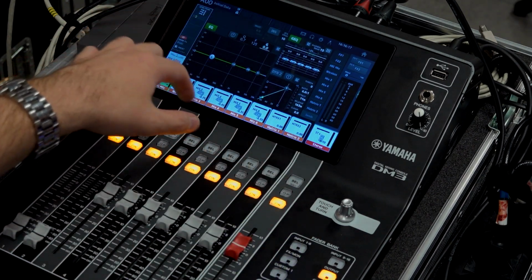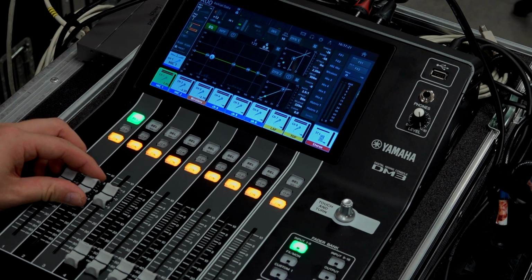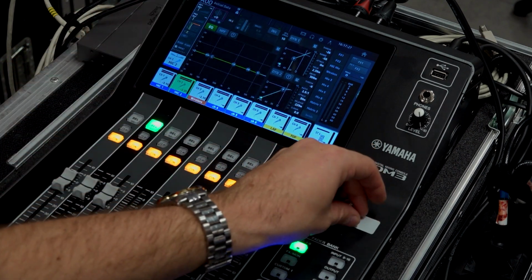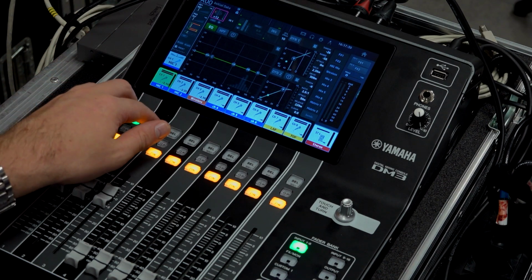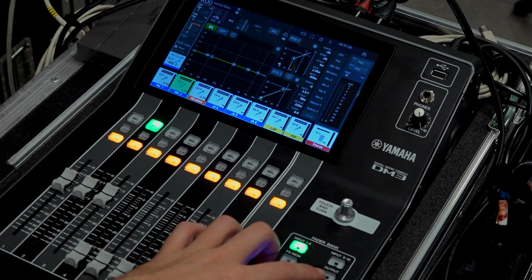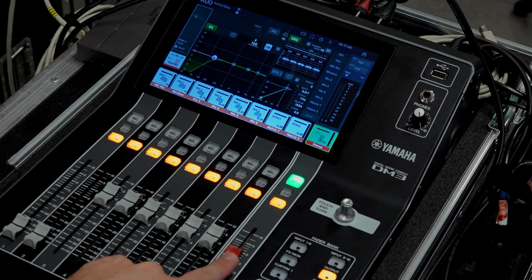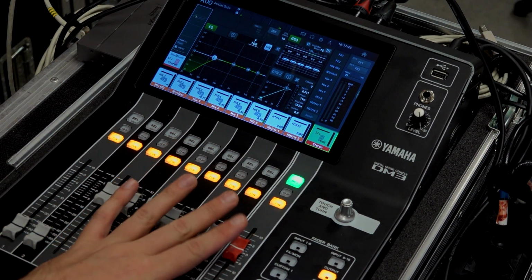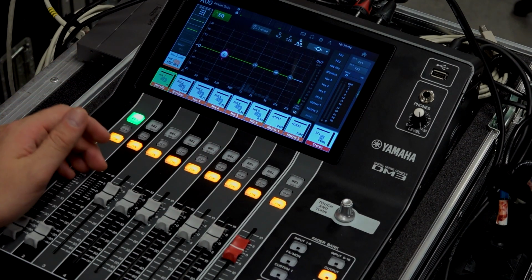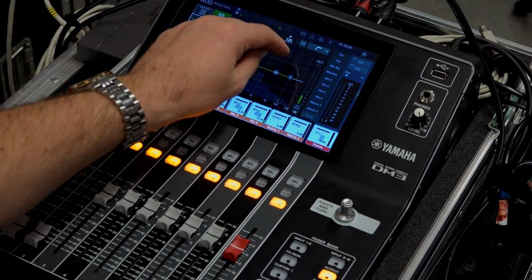Once your gain's complete, it is now time to do the ringing of your speakers. So for me, I'll keep my faders at 0 on the input channels. For both microphones, this will be the optimal level that I want to use. I'll have the gain on both microphones the same because in our case, they are the same kind of microphone. Then I'll go to the output channels and I'll make the stereo master 0. Most of the time, I do not change the stereo out because I don't want to affect the global output of everything. So my stereo output fader is all the way up and my input channels are all the way up. The only thing that is changing is the group channel.